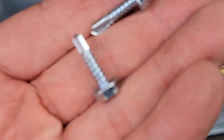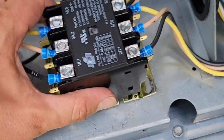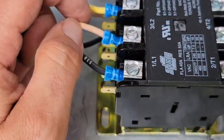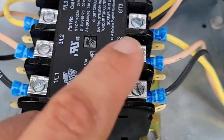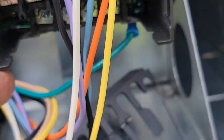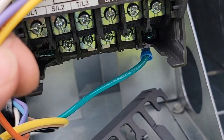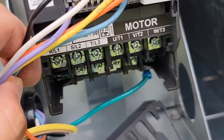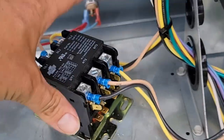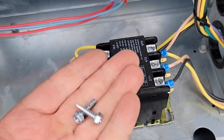I've got a couple of self-tap 5/16 screws to mount the contactor. You can see we've got the wires matching from inlet to outlet — black, brown, yellow on each side. Now you can see that the power in and out through the VFD has nothing on those terminals, so I'm using the contactor. Let's get it mounted.